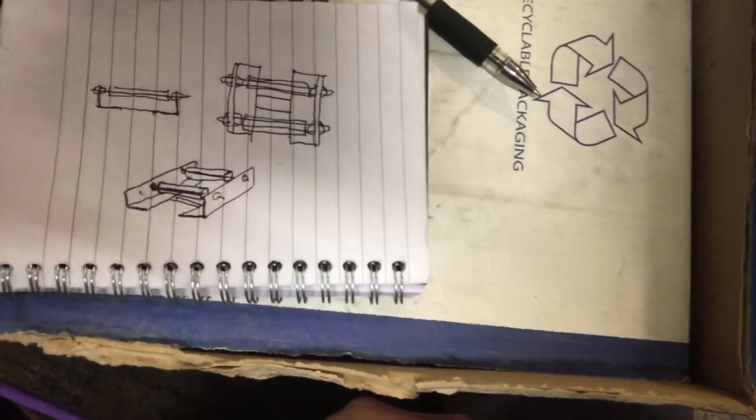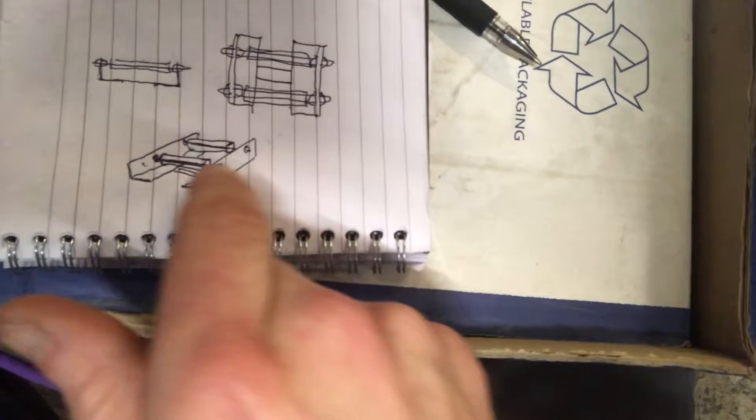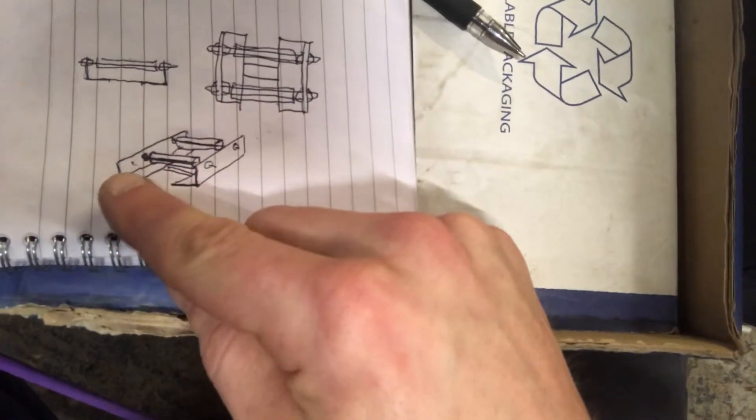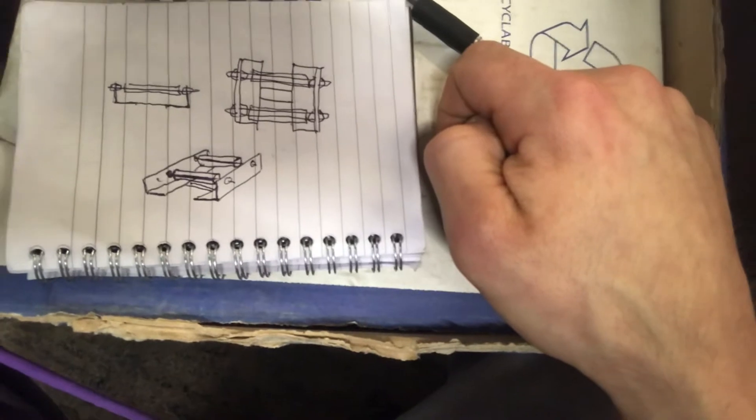This is my design — it's going to have angle iron on the side, a screw bar running through, and a larger pipe that the screw bar threads through which will turn freely. Hopefully that's going to give us enough resistance, with two side by side, to be able to push without it moving too much.